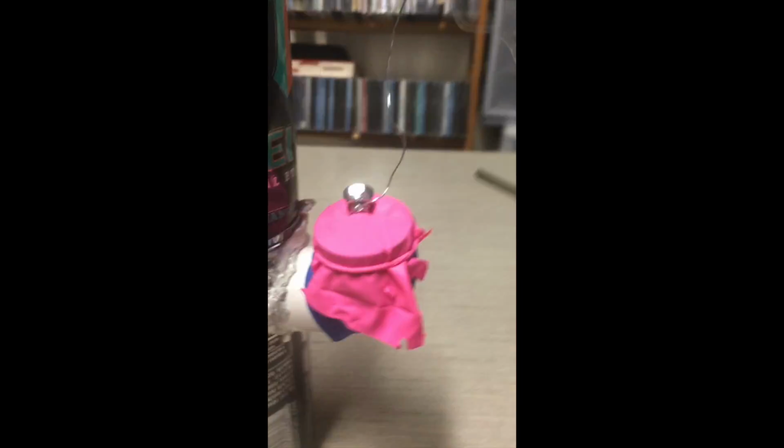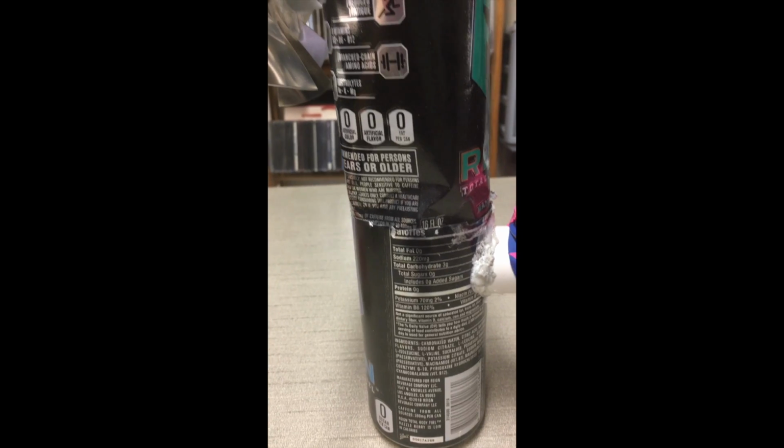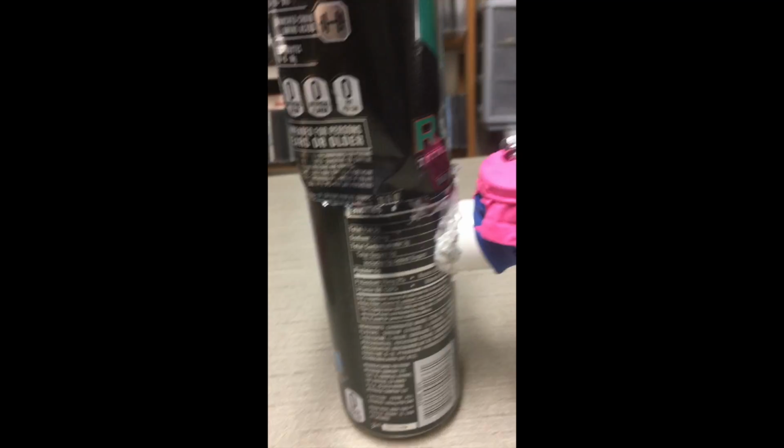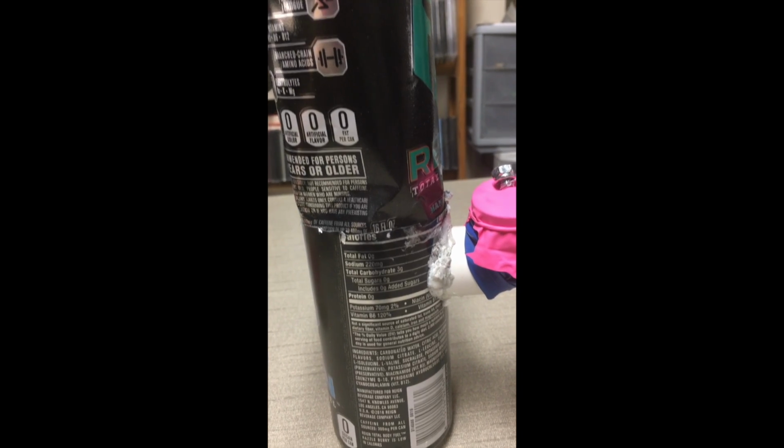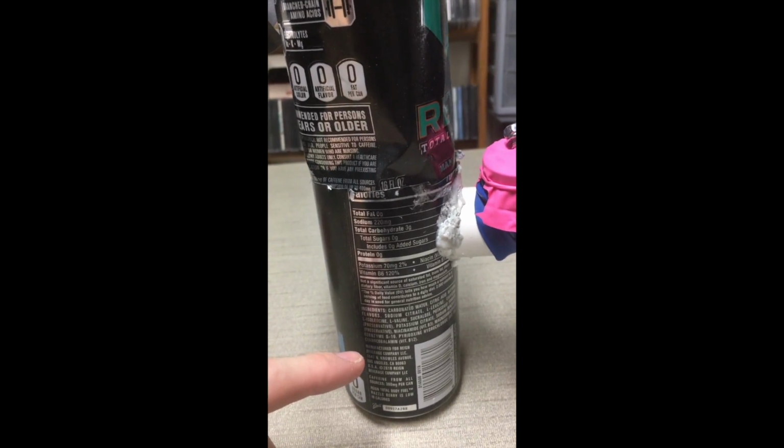So I would have to either replace one of the two cans or significantly reinforce the air loss there. And then also, between these two is supposed to be a string, but I am right now using thin steel wire to connect to the steel wool displacer. You're not supposed to do that for internal friction reasons, along with the steel not wanting to bounce up and down as much, so there's some internal resistance, again, friction with that. But my string wouldn't work because I have a natural twine string. I couldn't find fish line. So really, you would need an artificial string, you would need a better displacer, and reduce internal friction. But it does run manually.